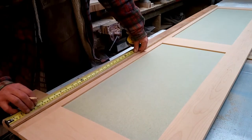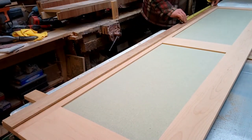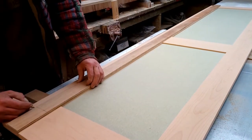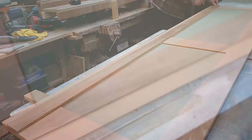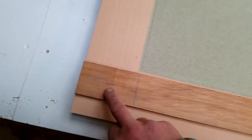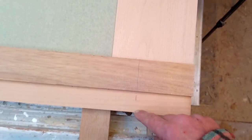I've cut a lath exactly the same length as the door. I've made a mark 100mm from the bottom, transferred that over onto the door. There are two marks, divided equally, with this one also 100mm from the bottom. Put a little T at the top but we're going to be working off the bottom. Have to make sure that's flush when you start. I'm going to square these over and then cut my hinges.